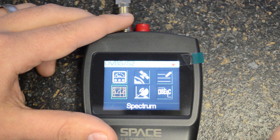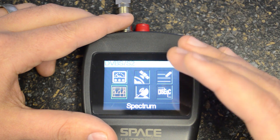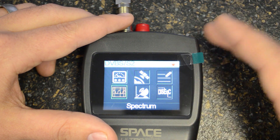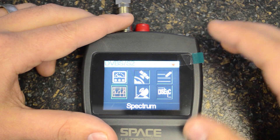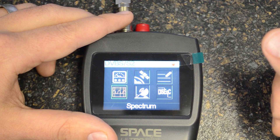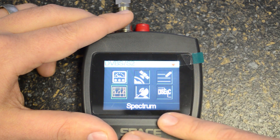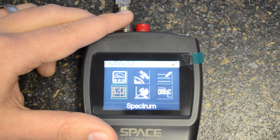There are other features to the meter on the satellite side, but that will give you a fairly good overview of how to use it when doing voucher installations or basic installations in a domestic environment. Please note that the maximum input into the meter is 100 dB, and the unit is compatible with both C-band and KU-band, and has all of the SATCR user bands programmed into the meter itself — everything has already been set up for you.